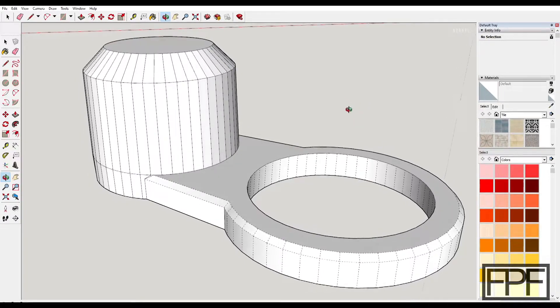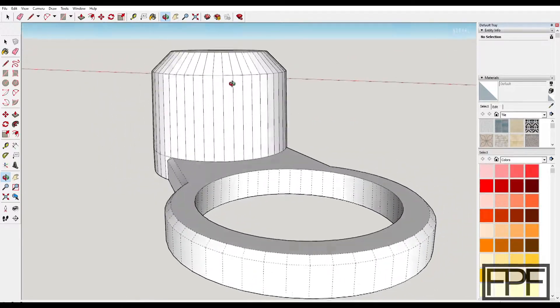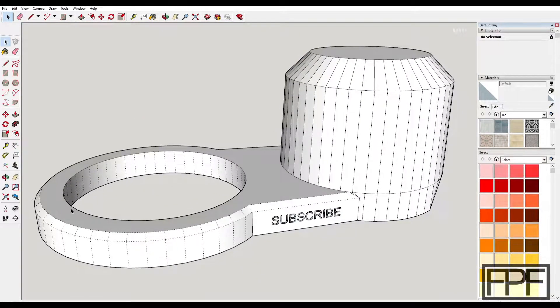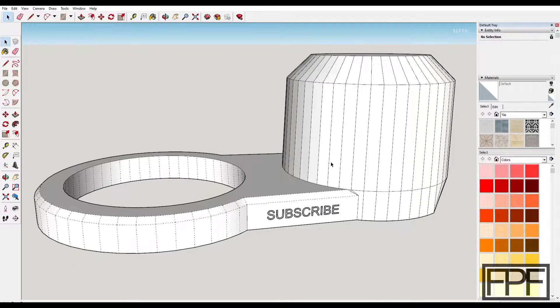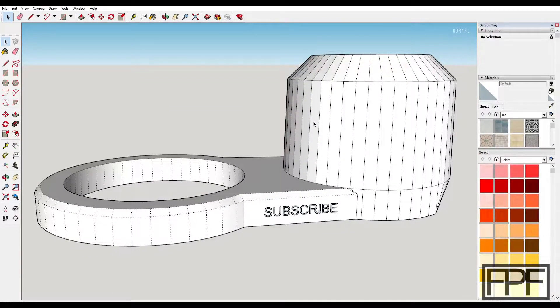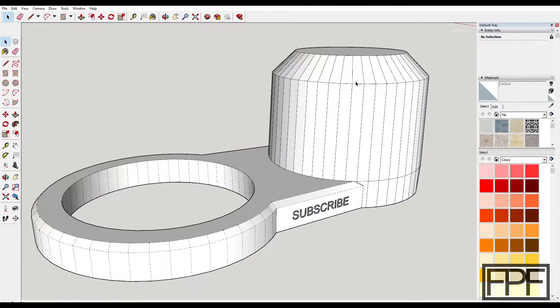Here's the design for this. Like I mentioned, it's a simple solution to a simple problem. The majority of the design time I spent was in getting the very precise friction fit of both the inside diameter of this ring here, as well as the outside diameter of this portion here. This is tapered as well, so when you place the brush tool down onto this, it's going to tighten up before you actually reach the bottom. That lets you adjust the friction fit and offers some support for variability in the inside diameter of that brush, and also accounts for some wear and tear as both the outside diameter of this wears and the inside diameter of the brush tool.